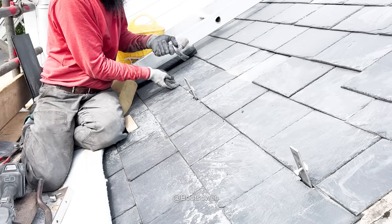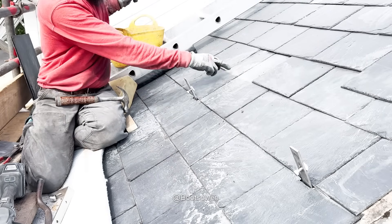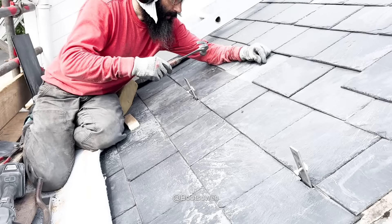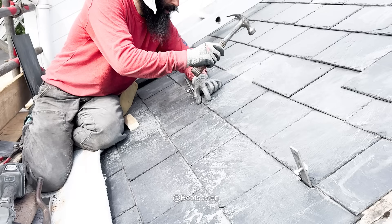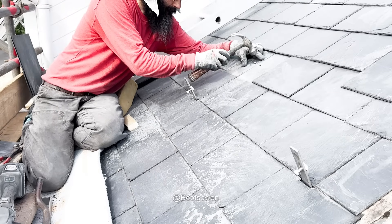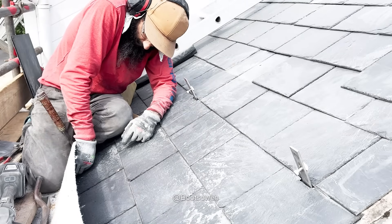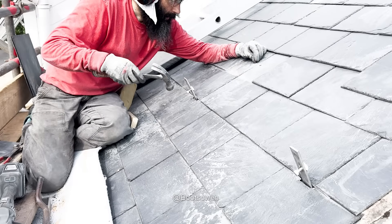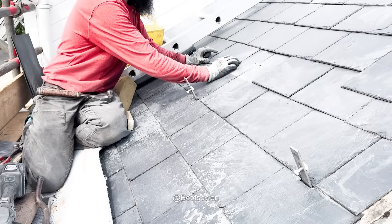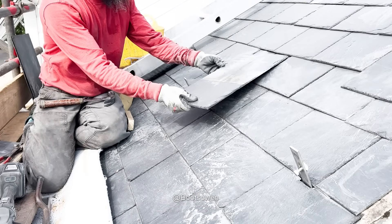That slate's back in, fully flashed, waterproof apart from the tile above. I'm happy water can't get in — lead above and below. The stainless steel bracket is not resting on anything but the timber below, so the panels, if they're rattling in the wind, are not actually touching any slates. Now this nail — I slip that back in with a copper nail. I think that nail goes in a little bit too easy, so I pull it out again — it's lost its grip. I nail it in again at a different angle because there was a hole there from the previous nail. On some of these slates where I've ripped out two nails and only put one back, I drilled a hole about an inch off and put a second nail beside it.